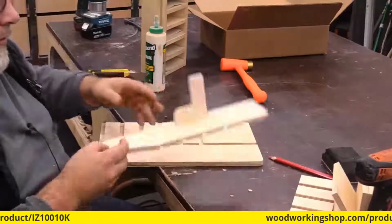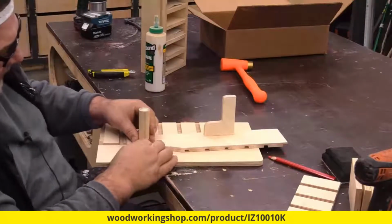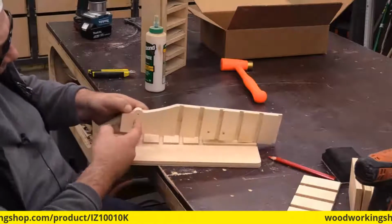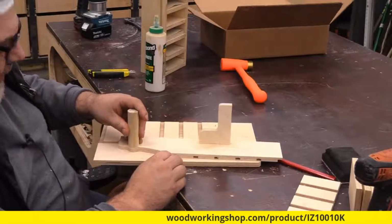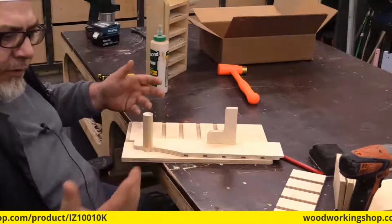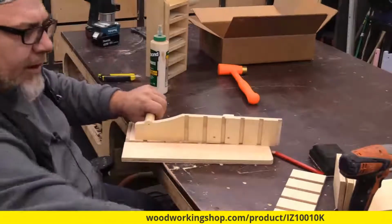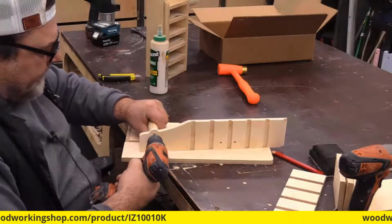And then the next thing you're going to want to do is to attach your dowel. And the dowel goes right here, pretty much flush with the surface. And once you have the dowel attached, again, it's the same scenario. We pre-drill the hole into the dowel, and then we'll add a screw for some extra security. So just a quick tip. I like to use a little bit of cyanoacrylate glue or super glue with an activator. I can put my part in place real quick, and then it's dry enough almost immediately. It makes it a lot easier for pre-drilling.